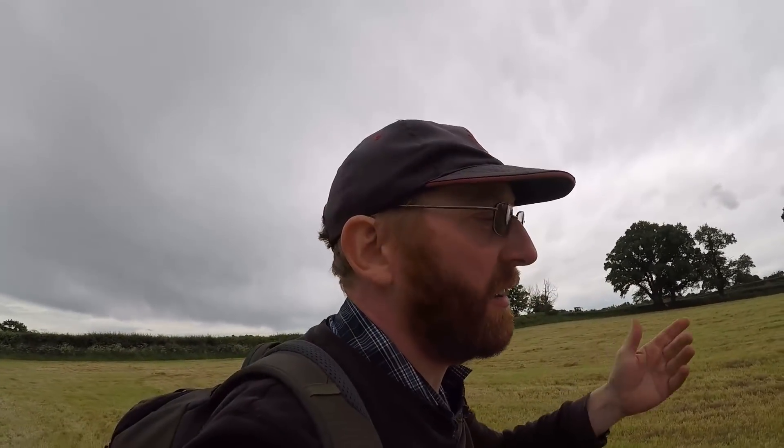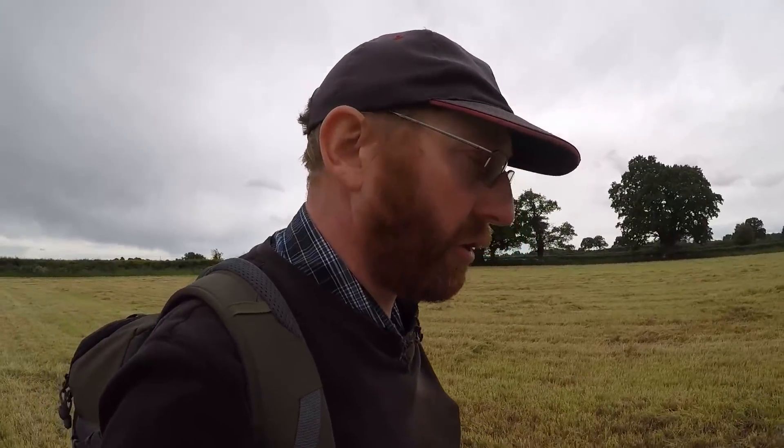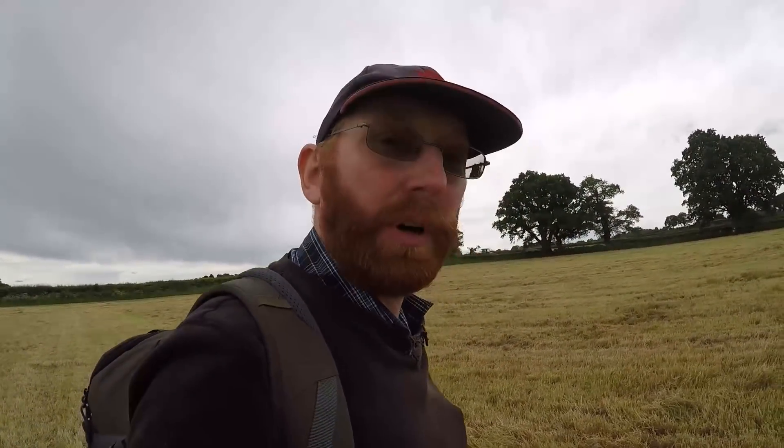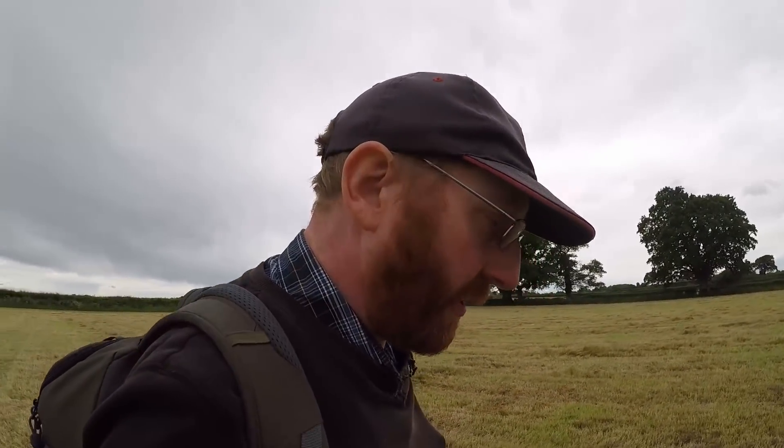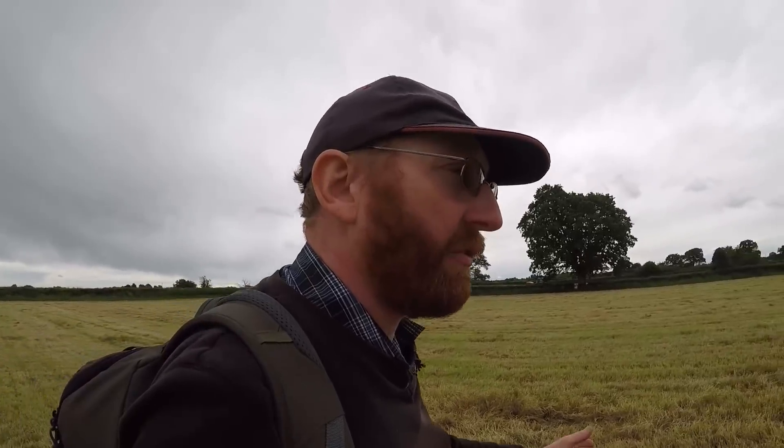He's certainly getting over the ground at 18 metres - so he's going about half as fast again as we would normally on 12. The forward speed's the same, but he's altered the vanes on the spreader to spread it out wider. What we're putting on is just straight nitrogen. You can see all this has been cut - this is what we did in the first little bit of silage. This is without doubt the hardest time of year to spread fertilizer because on this bare stubble you just cannot see where you've been - even walking across it you struggle to see where he's driven, never mind when you're in the tractor 18 metres away.